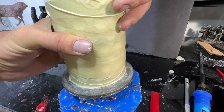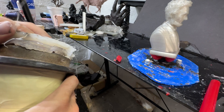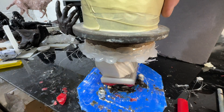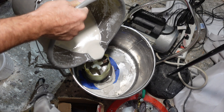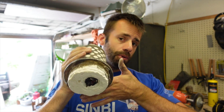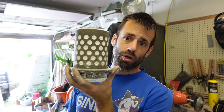It's the exact same process for the Polycast, except this time I'm going to try to use that hot glue O-ring I made. I'll still have to glue it down of course. Now with the Polycast, I shouldn't need to blow it out at all — there shouldn't be any ash or residue left over. It should burn out just like wax, so I'm going to put it right through the standard wax burnout process.